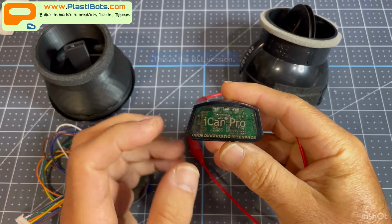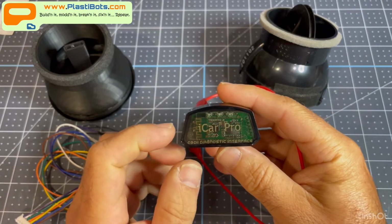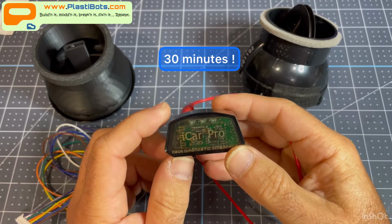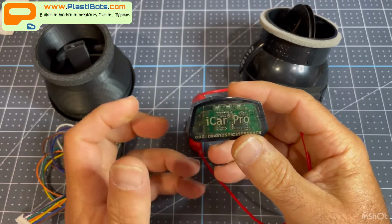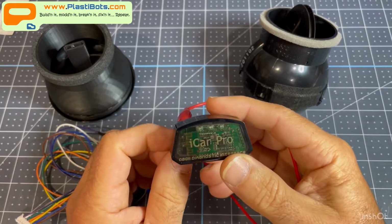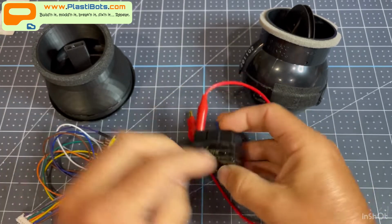I chose this unit because one, it obviously works for others, and two, it also has a power down feature, so that after essentially 30 seconds of inactivity, it detects the car is off and will power itself down. These things never truly totally power themselves down because it also has a wake up function, but they go into deep sleep mode, which uses in the vicinity of microamps versus milliamps. Basically microamps are a non-issue for a car battery. So anyway, I'm going to use that.